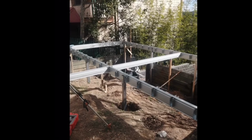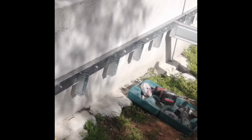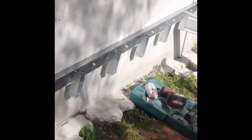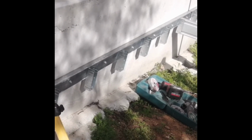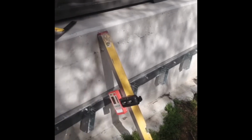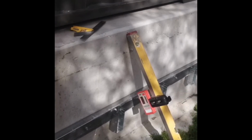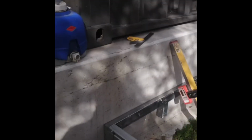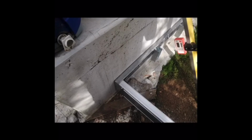Now, in some of the previous slides, I showed you that Mick was putting that pole plate together for the joist to run into, and you can see that pole plate here that's been fixed with masonry anchors into the concrete frame that's supporting the concrete bases supporting the swimming pool, and our beams are running from those connectors. I'm not kidding you when I say that our smart parts and connector system makes these type of decks very straightforward to build. Simple system.